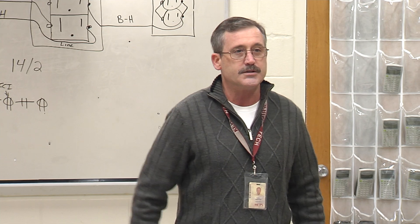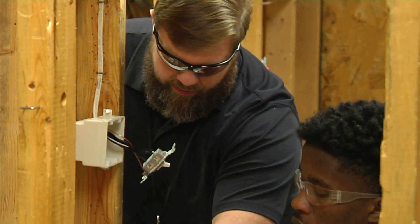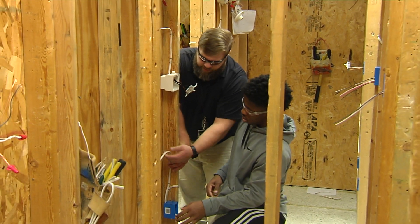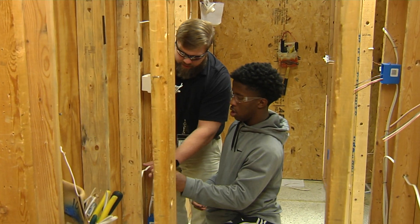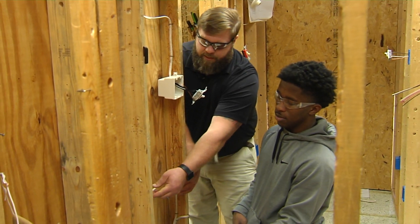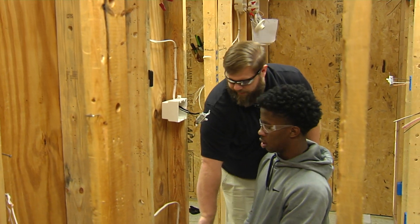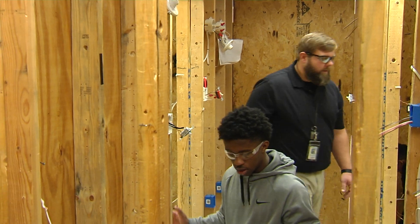Good, put on your safety glasses, get tooled up, let's go to the shop. And then you need one more staple on that side. When we're doing this, make sure this looks nice — you don't want the staple inside the radius of the bend, so keep it like that. Make this look nice and neat. What does the code say about stapling? Good — we put the staples where the code says. The GFCI is going to go there and your regular receptacle goes there.